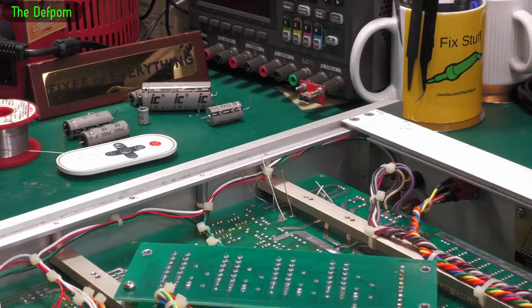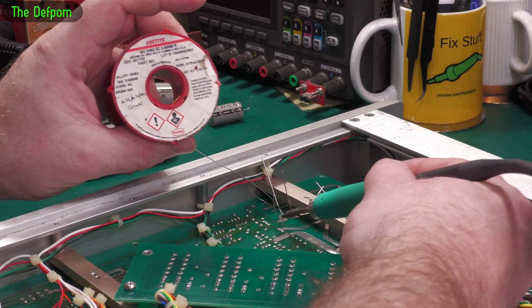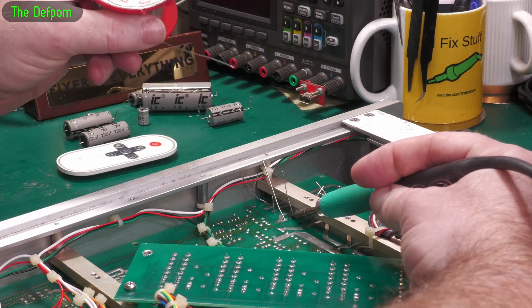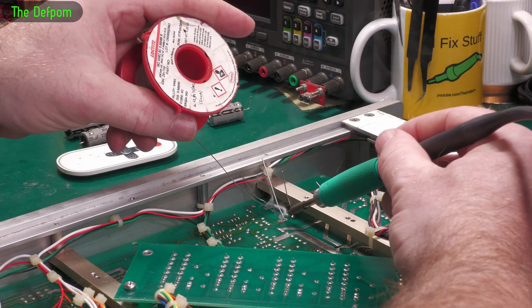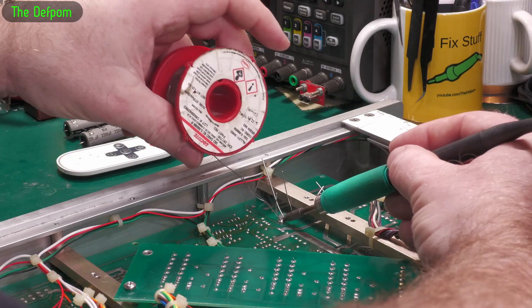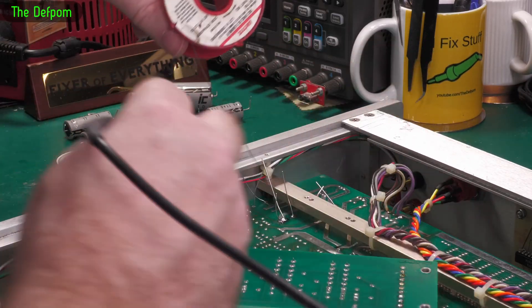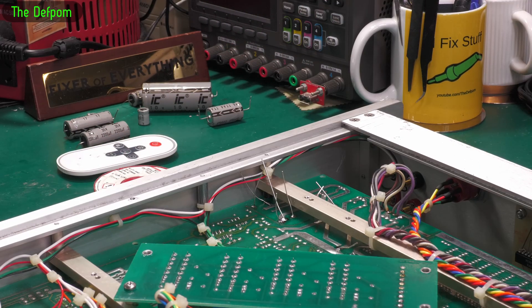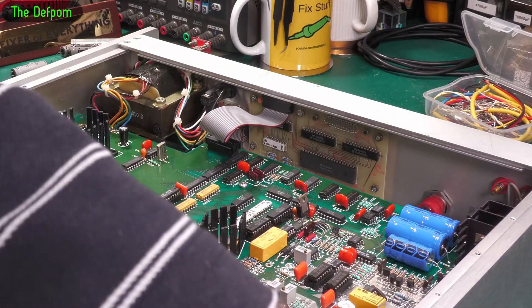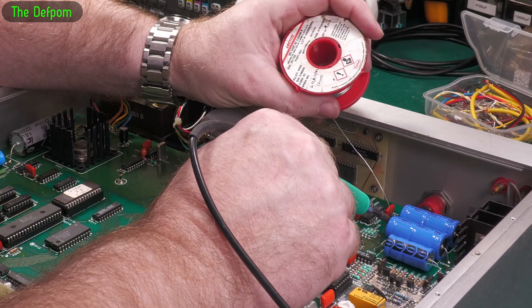This power supply section is not so critical. I'm just folding the last few legs in now. I had to take the middle capacitor off from the top and clear the holes out from the top, and then push it through from this side. I'm using quite a lot of heat here to try and get the heat through the board. I'm hoping I can avoid soldering on the top side - that's the intention, we'll see how it goes. The ground plane on this board is quite severe; I was having a battle with that quite a bit. I was checking to see if the solder has flowed through, and it has in some cases, but not all cases. So I was going to touch up this side as well, which is something I didn't really want to do, but it's going to be necessary. I need to make sure I've got good connections on both sides.